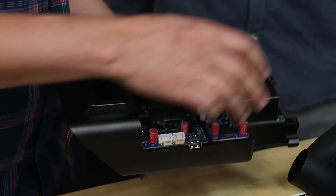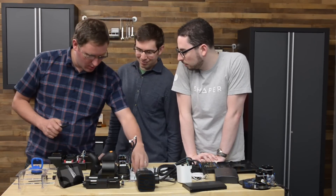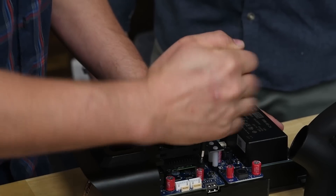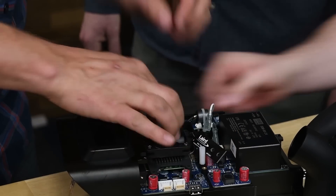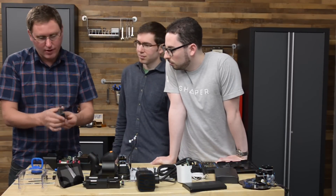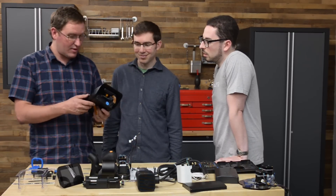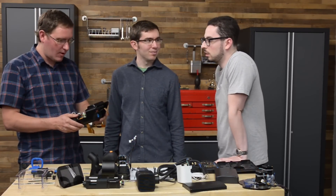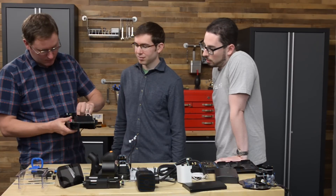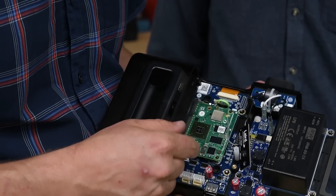This is your power supply? That's the AC/DC converter — supplying all the power for the stepper motors and the onboard computer. I'm going to go back to smaller screws. Just unplug the fan there and you should be able to lift it out. Straightforward heat sink. Is that Broadcom? It's an NXP — an IMX6 application processor. Similar in power to what you would find in a cell phone from a few years ago. On that board there is the communications and the application processor, memory, flash and RAM — all that good stuff. That's all on the daughter board, and there's more electronics underneath the daughter board.